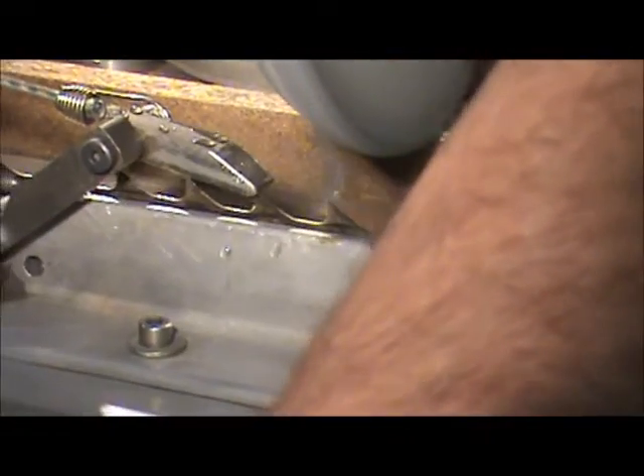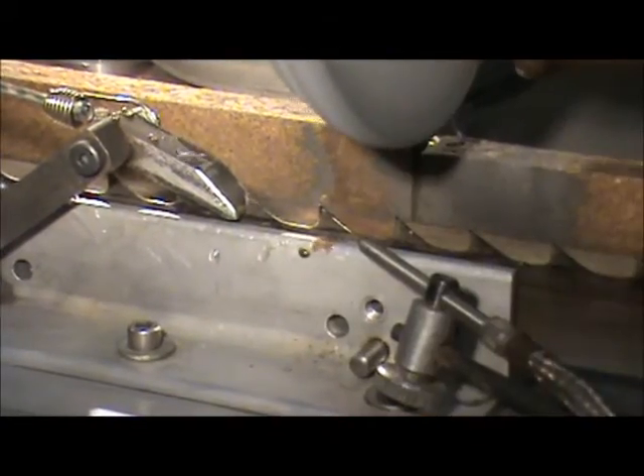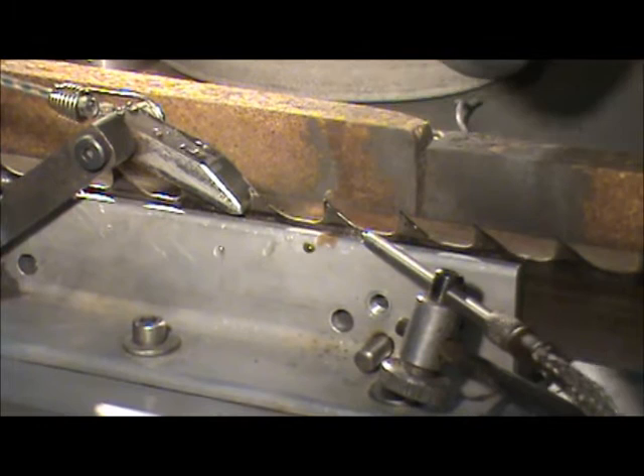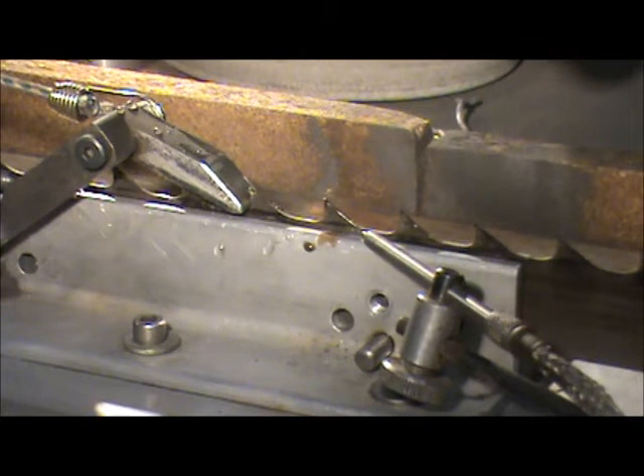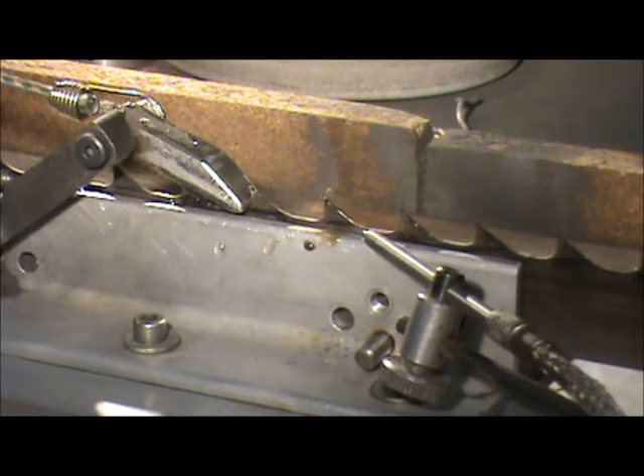You can see there are some broken teeth — this is a bad blade, so I'm just using it as an example. Nice light grind; if you want a little heavier grind just back the adjustment off slightly — you can see we start grinding a little heavier real quick. That's all I do. Hopefully you guys can do something similar, refurbish your blades, and save yourself 20, 30, 40 dollars a go-around. Hope you enjoy the video.